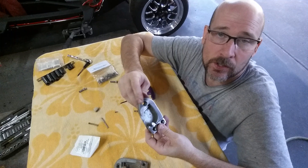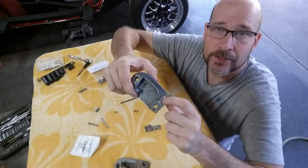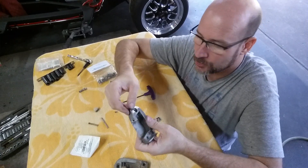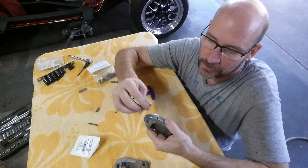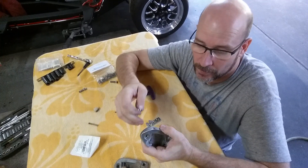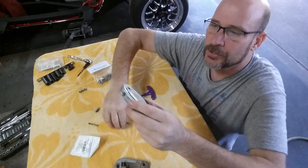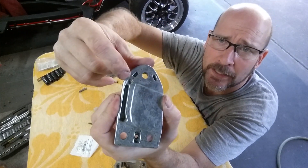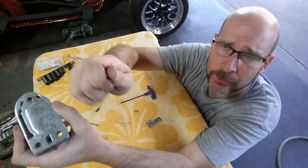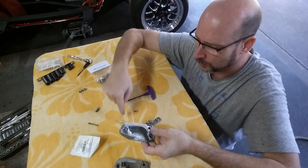After you drill and tap it 10-32 so the plate can bolt back on, the other problem you're going to run into is the pin. Once you take it out and grind that material away, there's no way of holding the pin back in. You could epoxy it, use panel bond, JB Weld or something — that'd probably be fine. But what I did was, if you turn it around there's a little indent with a flat pad right here, and I drilled it to 8-32 and I'm going to use a little Phillips set screw — an 8-32 Phillips set screw — to hold tension on it so it won't come back out.